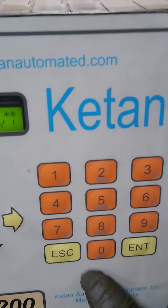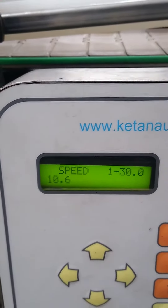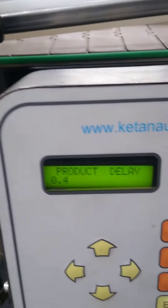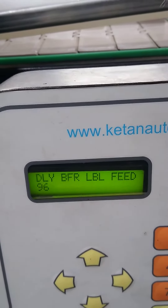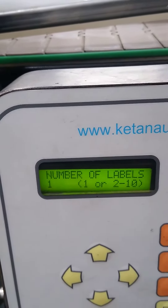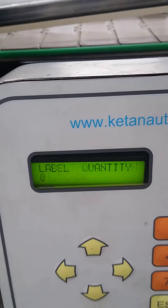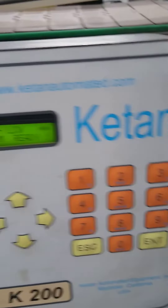If you press edit right here, it gives you the label speed. You press enter here and every time you press enter it goes to the next thing. That's the delay before the label feed, that's the delay after the label feed, number of labels — I'm not sure what that is even — label stop position, label quantity. And then that's program two, and it's saved. If you go over here and press eight, you can go through your program if you have different programs for different labels.